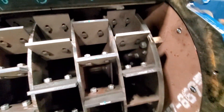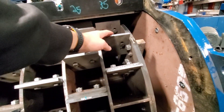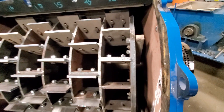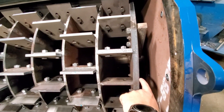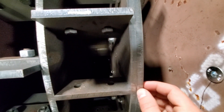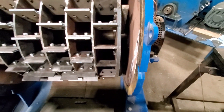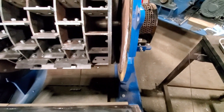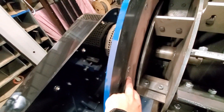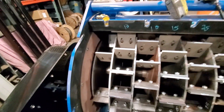The wear plates are reversible — they're adjustable, with one edge and then another edge, and you can flip them to use the other side. Everything in here is heavy duty with extra wear plate. Material comes in and hits this plate first. If I zoom in, you can see there are two plates — a changeable wear plate. Everything's built with long-term wear in mind. Same goes for the inside — you can see there's a changeable wear plate held in by bolts, and that whole plate is swappable.